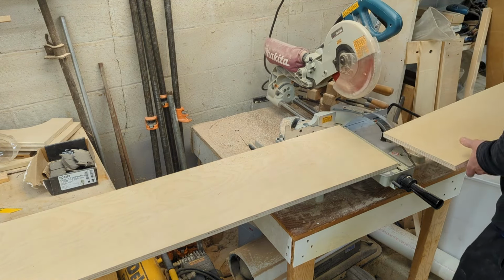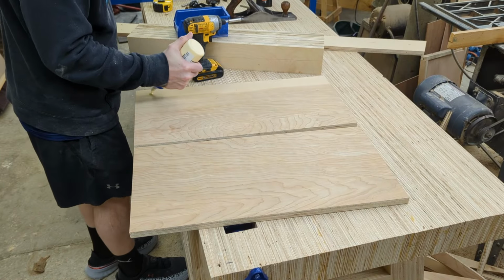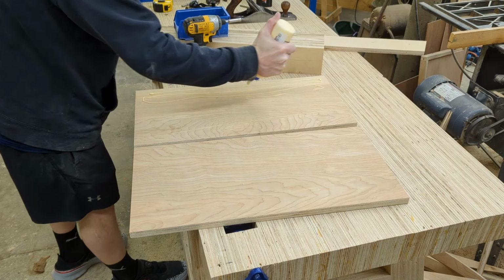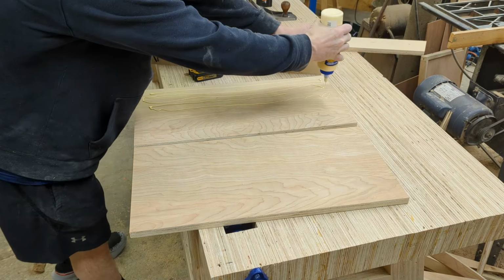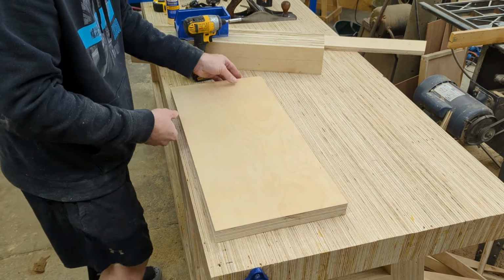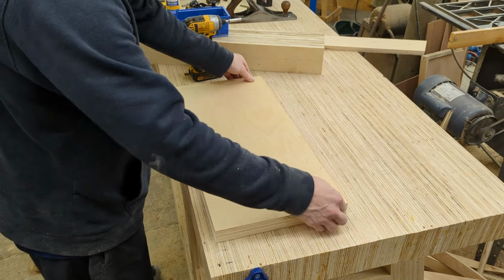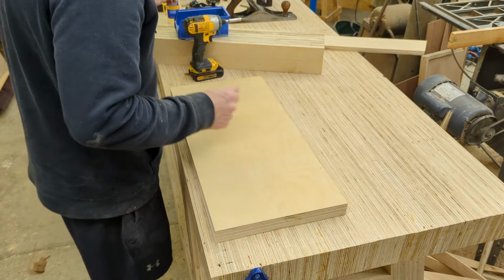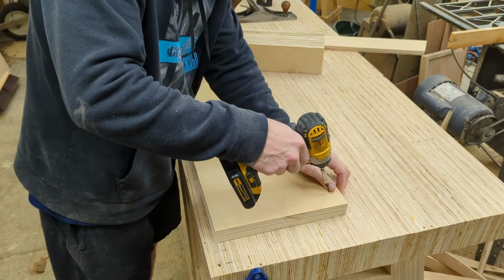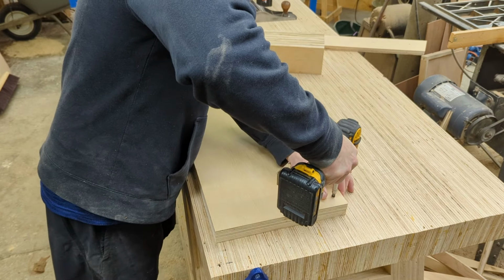The base has a built-in tenon in the main rails of the bench, and I have cut a small mortise in the top of the leg in episode 5, Grave Design Error, as well as a mortise into the underside of the top itself, which was done in episode 6, Gluing Up the Top, part 1. There are no real measurement rules or best practices from history that I know of for the base, so I decided on 12 by 25 inches, including the tenons, for my final size.